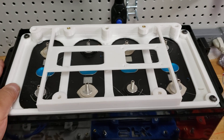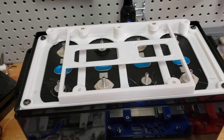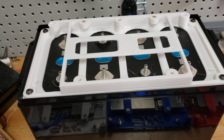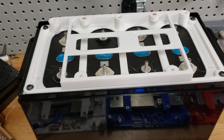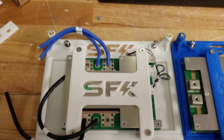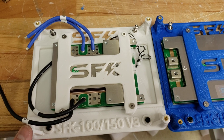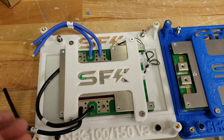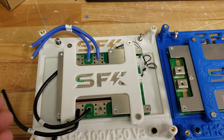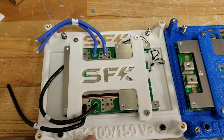One of the feedbacks we've had from people is that some people really don't need the high amperage capacity burst output. They just would like to have a lot of power in case they need it, but for the most part they're not requiring 150 plus amps — their usual amp load is well below that. To address that, we're going to be coming out with a 100 amp BMS. This will be compatible with our app and function very similarly to the 150, but it will be quite a bit more affordable, designed for up to 100 amp discharge and around 50 to 60 amp charging. So for normal use, like in a solar installation or when you have multiple batteries ganged up, this will work quite well.